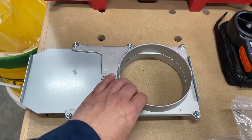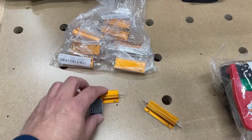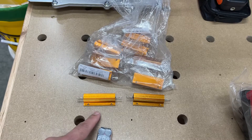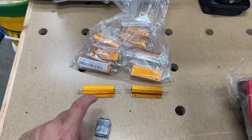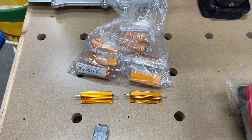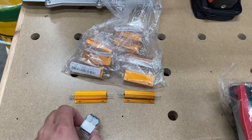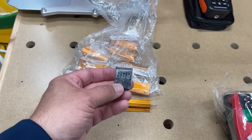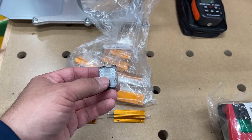So try something different — that's project number one. Number two is part of my RC stuff. When I go up to the field and have leftover batteries that are fully charged, I need to put them to storage charge. I have some little things for it already, but I want something that's going to pull down a gigantic 6S 5000 milliamp pack quickly. There's going to be a basic one and a fancier one with voltage cutoffs, running fans, and cool stuff like that. I'll be using these little LiPo checkers as an early warning system so I don't pull it down too fast.